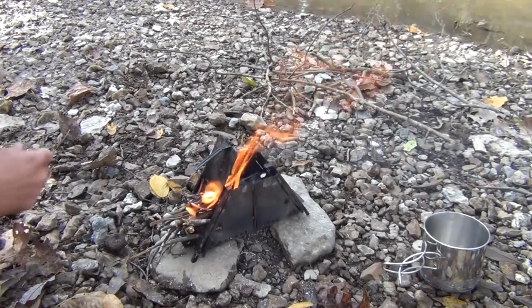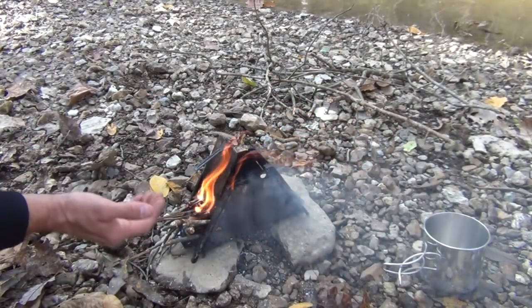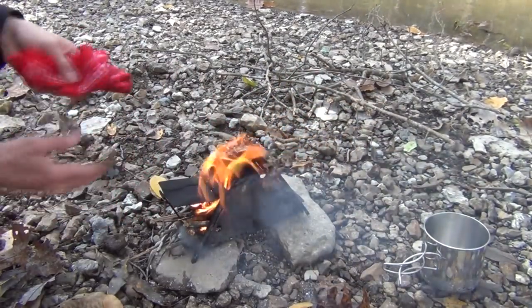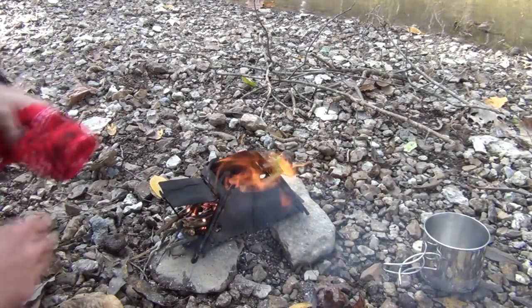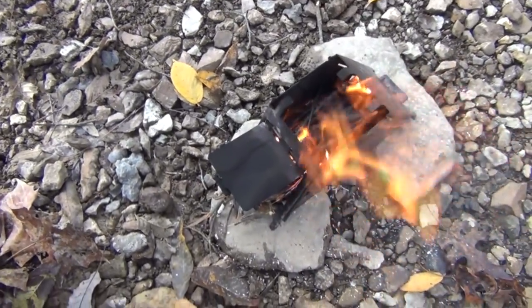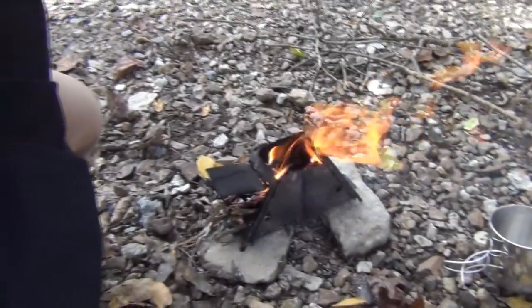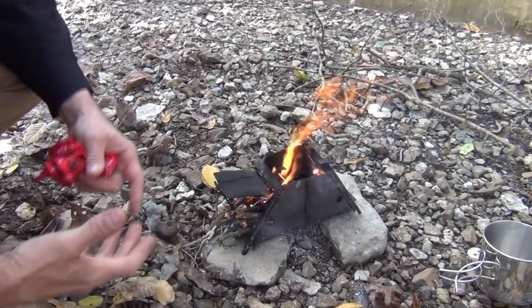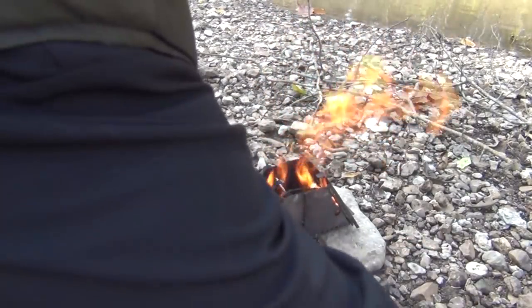We now have a pretty good burn going. I've left this cover up until it gets that way — I want maximum airflow out through the front, so it has a little bit of a rocket stove effect. Then very carefully you can put that cover down, because obviously that would interfere with our pot. We've got really good flame coming up. If you look down inside, you can see a good pile of wood and embers with a coal bed going in the bottom. This will burn for quite a while. That's basically how you get it started — most wood stoves are like this, but each has its own unique issues. You have to learn what your particular stove does and how it reacts.